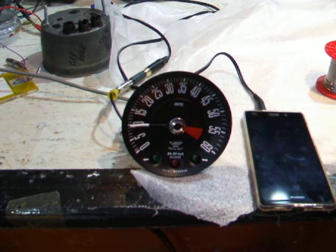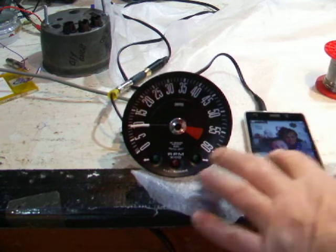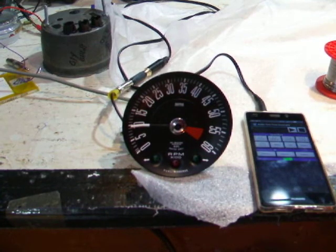What I'm using at the moment for a tone generator is actually an app on the phone. I find these are very, very accurate — if it says 50 Hz, it is 50 Hz. Signal generators can be a bit off if they're one of the older types, so for good quality calibration, using the phone is the way to go.